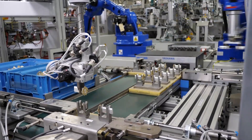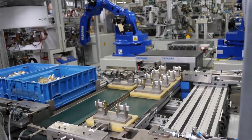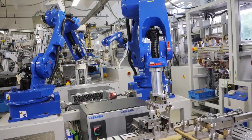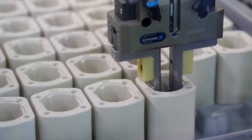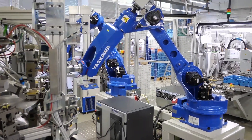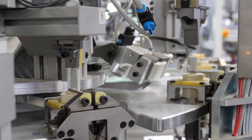The ETI combi version has a double indicator of fuse link operation on the front and on top. The first allows good visibility of the indicator when the fuse link is mounted in a fuse rail or fuse switch disconnector, and the second allows for use of a micro switch for remote signaling of fuse link operation.